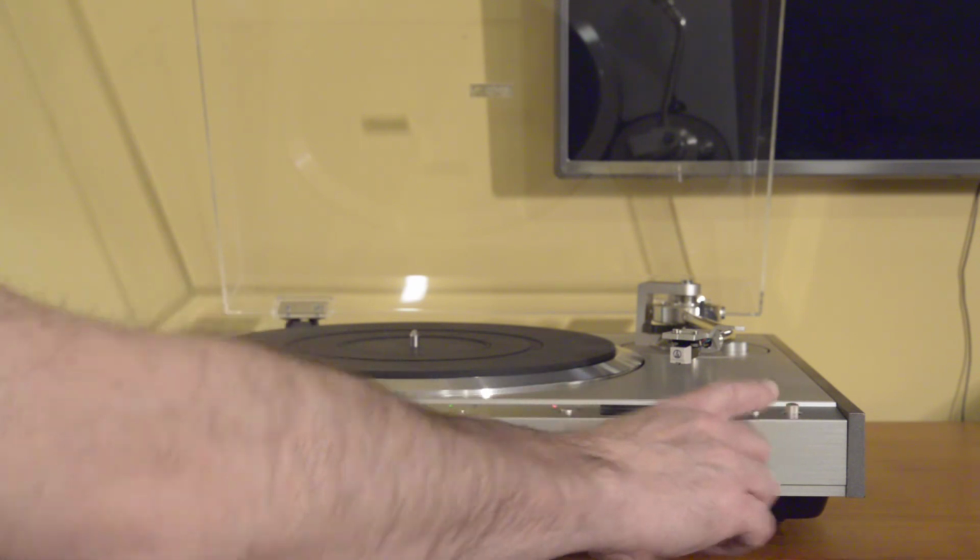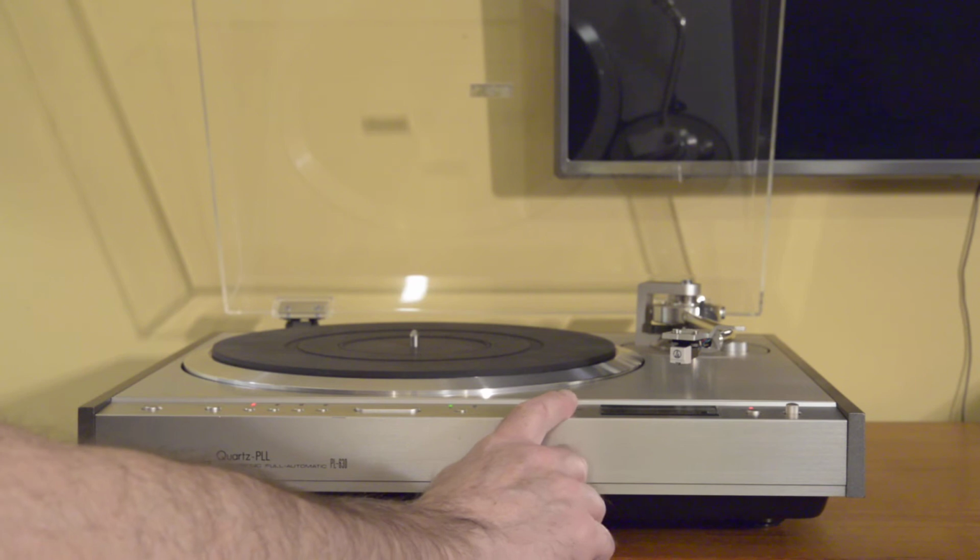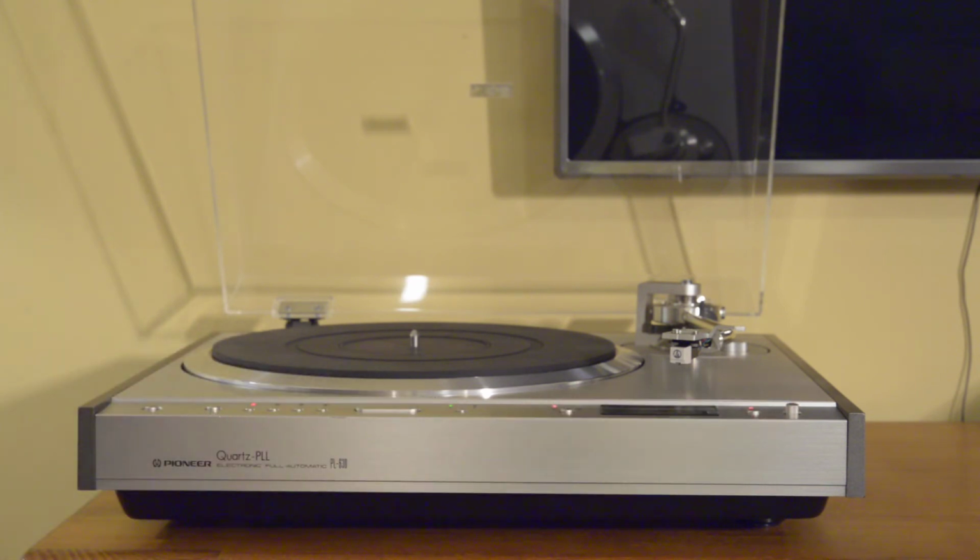These three controls are related to the pitch. Those need to be cleaned very, very thoroughly with DeoxIT. So I flush it very thoroughly one day, go back the next day, and then typically anywhere from 2 to 4 weeks later, I'll actually go back in again and give them a final flush, just to really give it good, stable speed performance for a nice long time. So that's all been done.